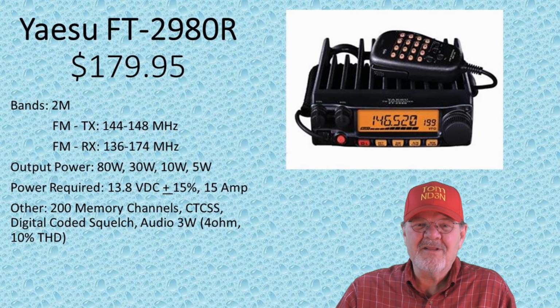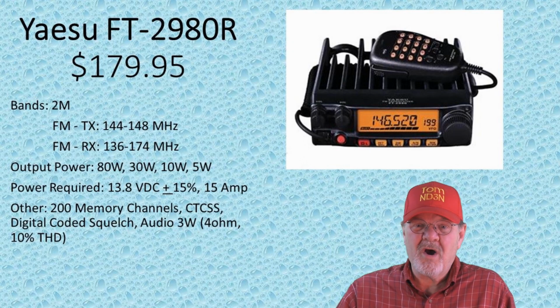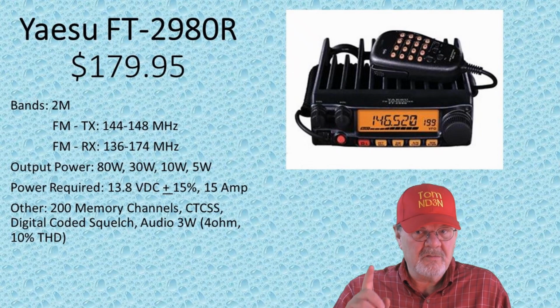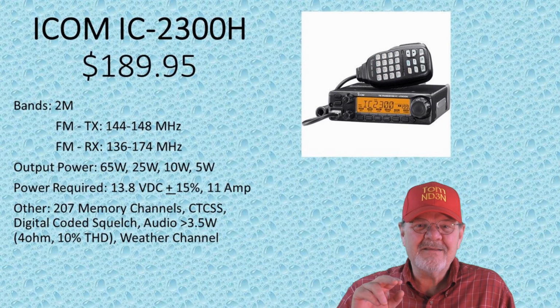Its output power is selectable between 80, 30, 10, and 5 watts. It will draw 15 amps at full power. It has 200 memory channels and an audio output of 3 watts into 4 ohms. Into 4 ohms, guys.